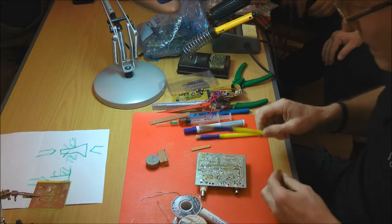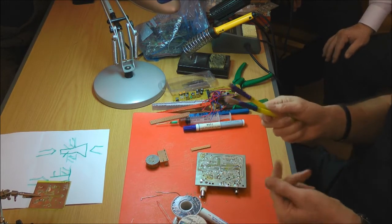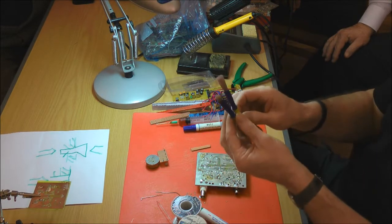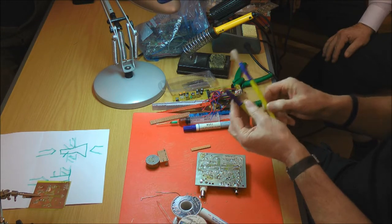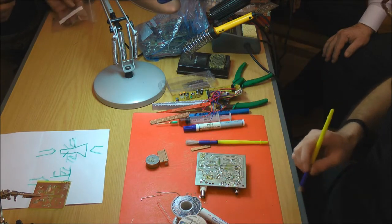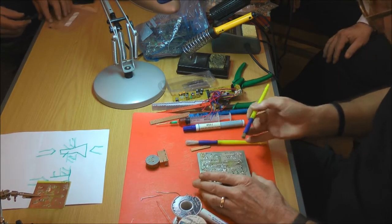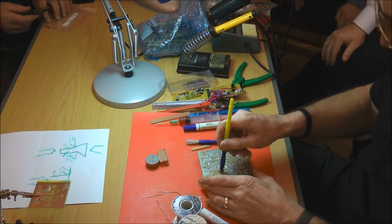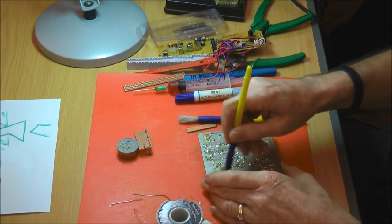It's still fiberglass, is it? These are just ordinary paint brushes. Oh, are they? Right, yeah. So any cheap sort of craft brush will do for that. These were both the same, and it's literally a pair of scissors and giving it a trim. So it gives it a bit more stiffness, so you can clean. Haircut. So where you've actually had rework, your flux residue, the isopropyl alcohol should remove all of that. So it should bring it back to completely clean.